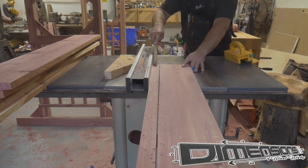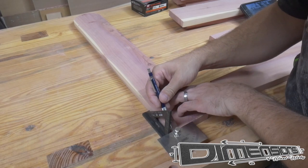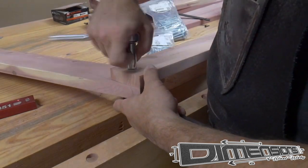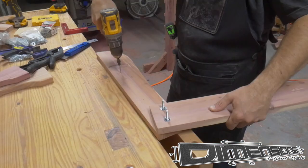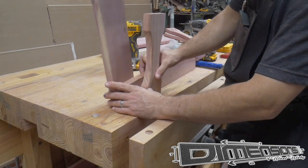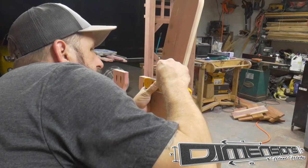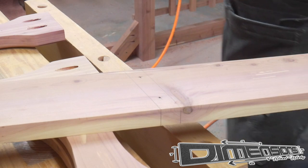Back over at the table saw, I begin to cut out the slats for the seat on the swing. I again go to my angle finder to establish that angle, then use the bottoms of those boards as a pivot point, drive in one screw where I'm happy, then replace that screw with one bolt, make sure I'm lined up, then drive in the second bolt that will hold these pieces securely together. After drilling a couple of pocket holes, I secure the armrest support to the seat bottom and the armrest itself to the armrest support and the seat back. I'm trying to make sure that I stay level with my screw line so that I get a good grab with those screws when coming from the backside into the frame of the swing.